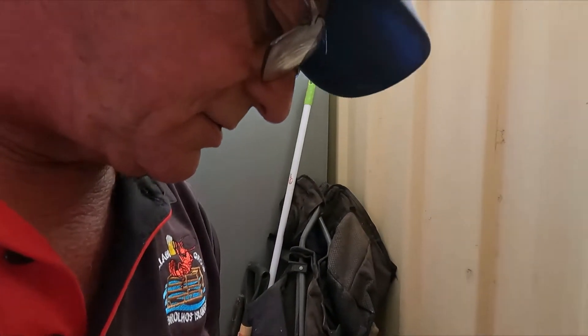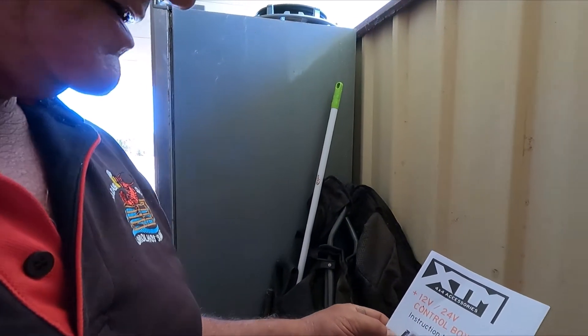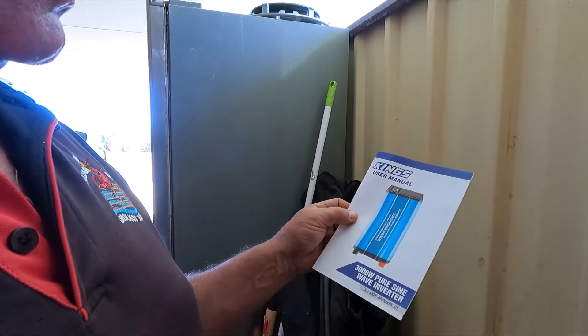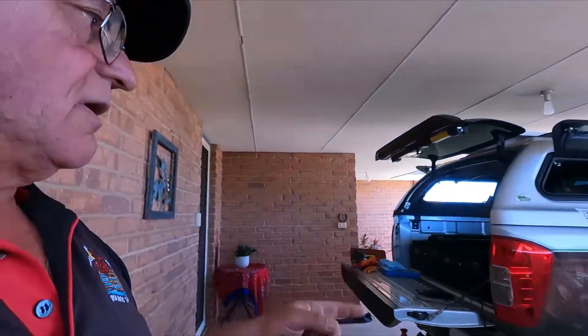What we've got in here: the MPPT solar controller and the XTM. And we've got the Kings 3000 watt pure sine wave inverter. I put a 250 amp fuse in the back. Normally I'd recommend minimum 300, but I put 250 there just in case I've overloaded, and because I'm running on the one battery I don't want to cook it.